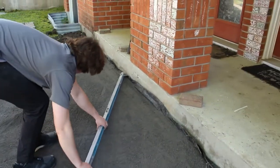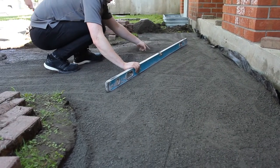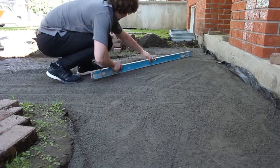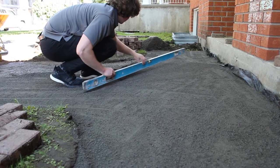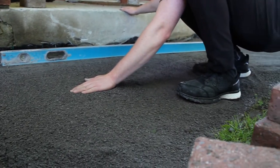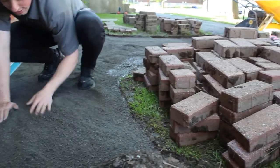I'm asking my assistant to fill in the voids. I'm using the level to spot the voids. You can see at the end there's a problem where it's humping a little bit. So I'm using the stone dust to fill in the voids, smoothing out the humps and filling in the low spots. I'm actually over-raising this because I know it's going to drop when we compact. I'm going to slope it up a bit and put a lot more gravel on this side.